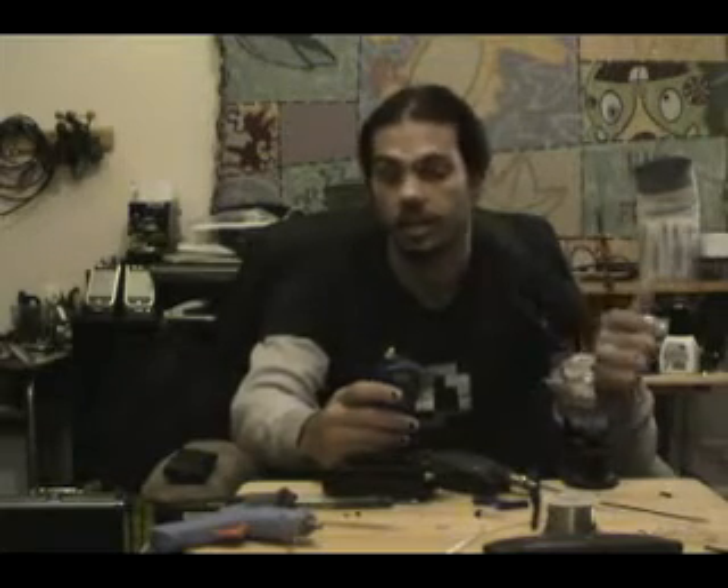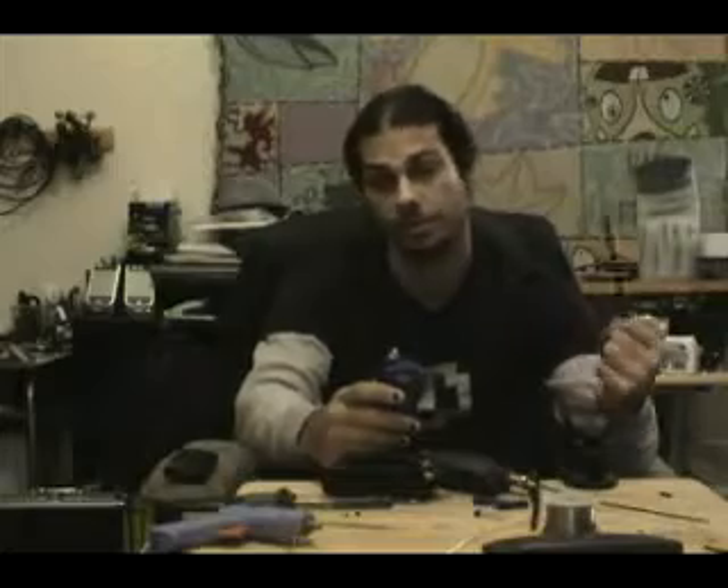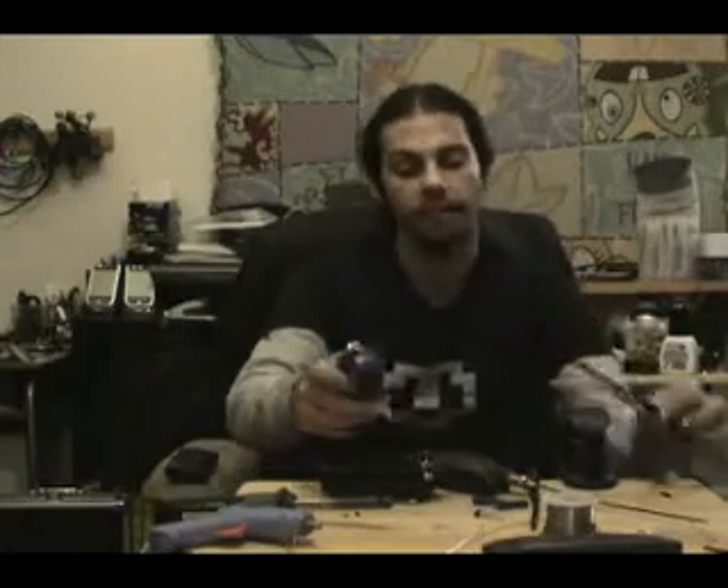This tiny little blue radio — this is actually an off-brand piece. I still need to do a few minor adjustments to it to get the connector in. To cut the stub piece off that used to house the old antenna, I just used a coping saw and chopped it off. This is housing a standard SMA jack — they're very easy to obtain. Standard amateur radio supply shops will have them. You can go online — I actually do offer supplies for both Wi-Fi and ham radio if you need.